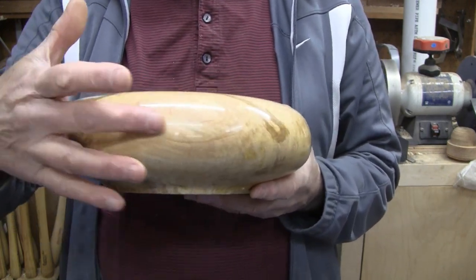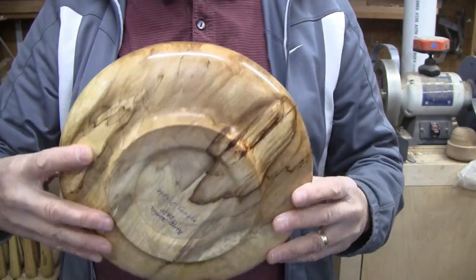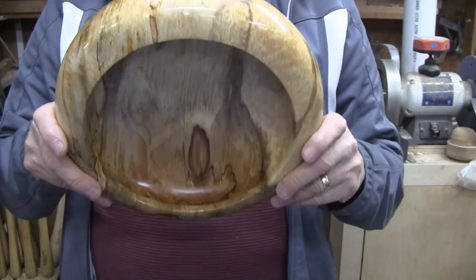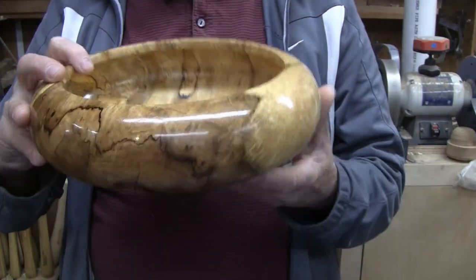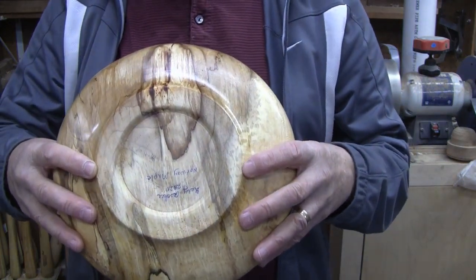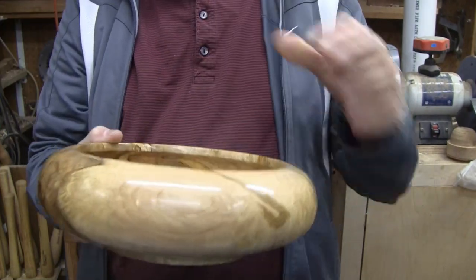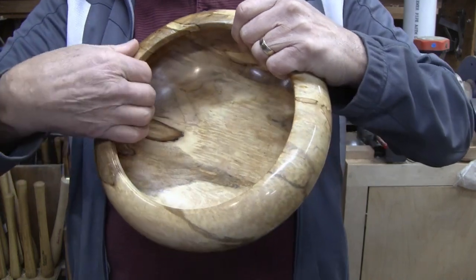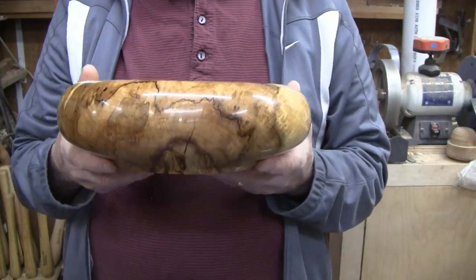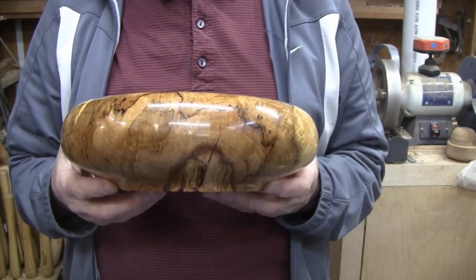The spalted Norway maple bowl. It has some beautiful grain going on — starting with this area with no spalting, then you get a little bit, then quite a bit more, then over to this area here that's just beautiful with a lot of spalting and wonderful colors. I love it. And the inside — look at that — just as beautiful. It finished ten and a quarter inches in diameter, three and a quarter inches tall, and the base is five and three quarters in diameter. Once I established the base, I turned an angle up to here and then made this about a full round. I let the rim go clear in here and the walls are about three-eighths thick, cut underneath into here. This might be one of the most beautiful pieces of wood that I've turned. I hope you liked it as well. Special thanks to Dave for sharing this beautiful piece of wood with me.